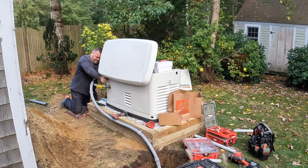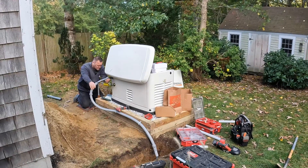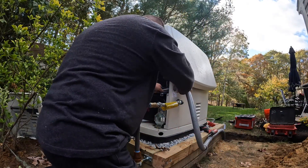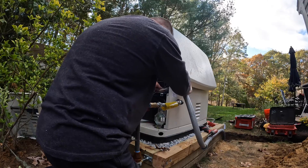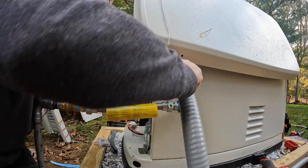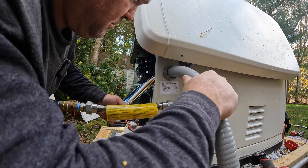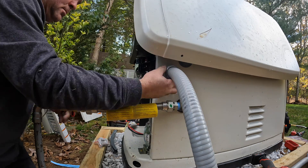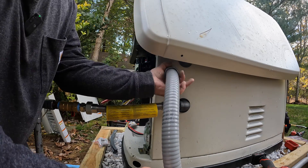Open up the book, read it if you're going to try to do this yourself, and find out the limitations as far as positioning the generator. If you're in a state that requires permits, you'll probably have to submit a copy of the property survey before zoning approves placement. Make sure you have three feet of clearance on either side and a minimum of five feet away from any opening. In some towns in New Jersey — like Clark or Cranford — you can be five feet from the property line; in Springfield it may be ten feet.